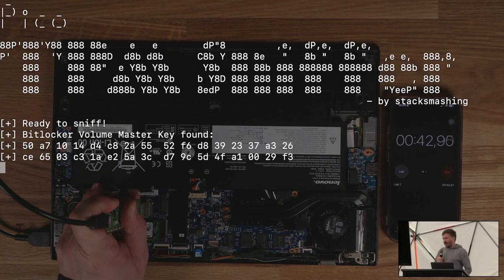And so it turns out that a lot of laptops actually have these pins exposed very easily on the backside for debugging purposes. On this Lenovo one, there's one special thing. On production hardware, they don't give out the clock signal. And so you don't get it on there. You could just solder. But in this case, I essentially emulate my own clock. I just wait for the first falling edge, then I wait 20 nanoseconds. Yeah, and so $4, very sophisticated, and lengthy access of 42 seconds.